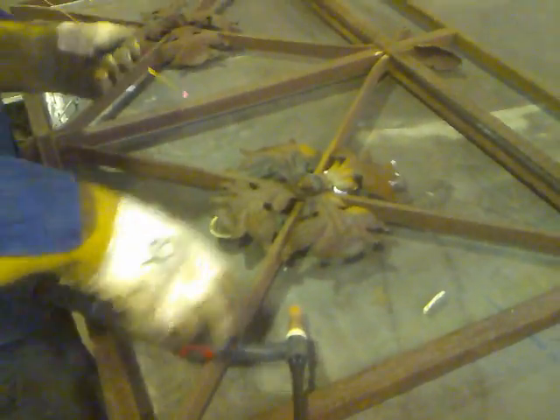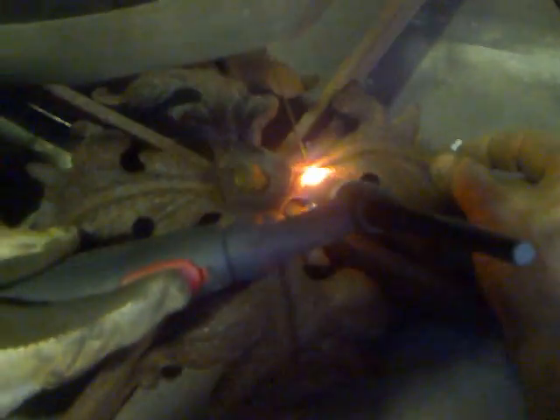It moved, so I've got to replace it. It's on 19 amps, using a 0.9 tungsten to get the low amps. Wire-brushed the area first so he doesn't get porosity. I'll just go in there now.